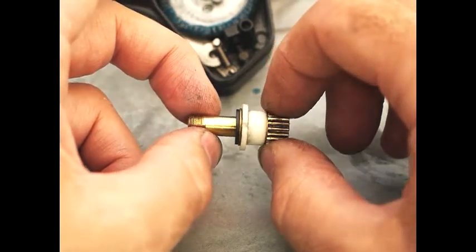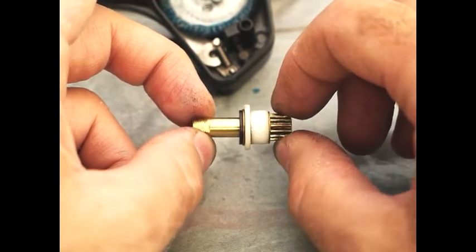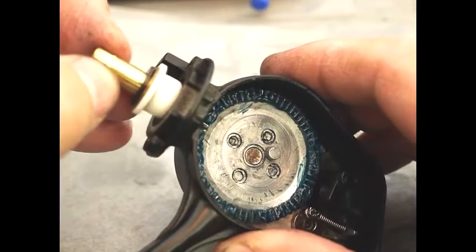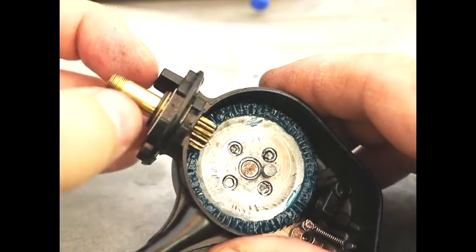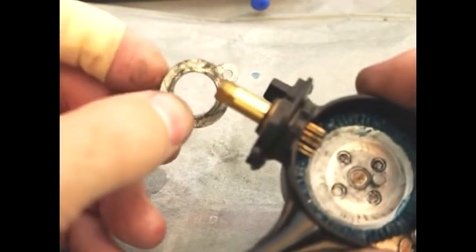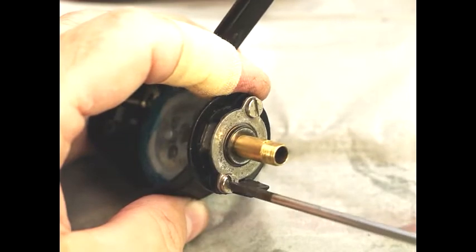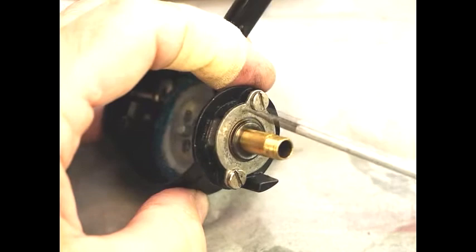downwards onto the bearing assembly, and then there's a loop collar that goes on over that, which we'll show you. Right, so this is the bearing assembly, and that goes on like so. We are eventually going to put a bit of grease on that brass over the top of there, which kind of holds it on, I guess. We've got this, which is going to be screwed down. Okay, so just tighten those up so they're firm, not mega tight, and you've now got your bearing assembly here,